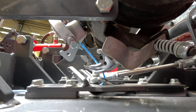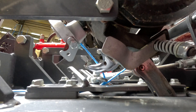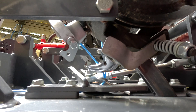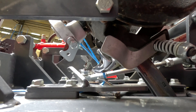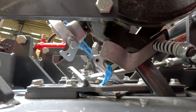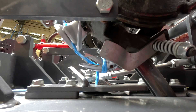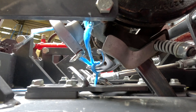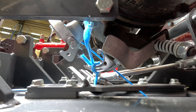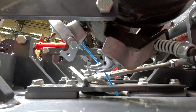Let's take another look. The needle advances and the twine finger rotates back, pushing both twines into the twine notch. The two twines are in position and the bill hook begins rotating. The twine clamp also starts turning, grabbing the new twine strand and releasing the other. The bill hook is holding both strands and the knife cuts the twine. When the bale is pushed down the chamber, the new knot is pulled off the bill hook and a new bale is formed.